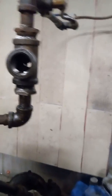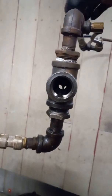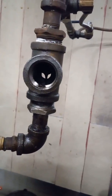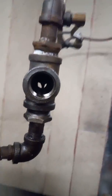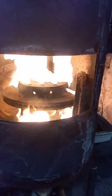Then I'll knock this down to where I'm running off the needle valve here - so this bypass is shut off. I can turn the needle valve down to nothing. If I go one complete turn, that's about the flow I get. I'll usually leave it one and a half to two turns for normal flow. Two turns for a normal flow - it's a good burn.